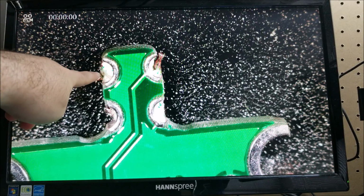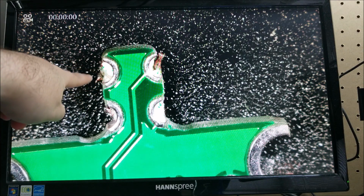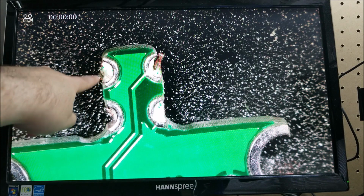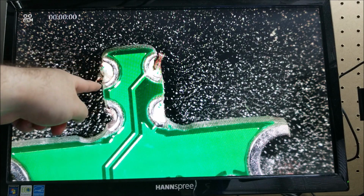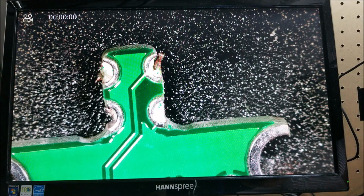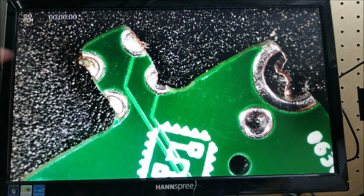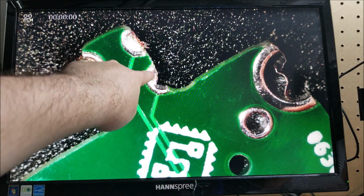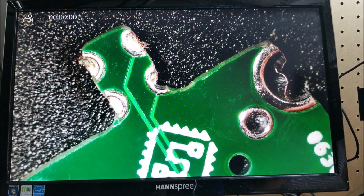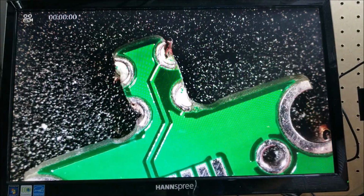And here you can see when they routed off these little bits, it left some of the extra FR4 pushed inwards. I saw on one board, it looked like the inner track was actually ripped off. That could make this board not function, because I route the data lines on the other side like this. If this metal piece inside were ripped off, there'd be nothing to connect to when you go to solder it onto the board. So yeah, that's why I ordered plenty of extras of these, just in case I got duds.